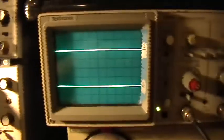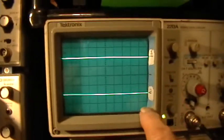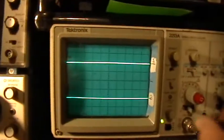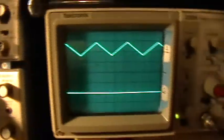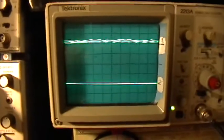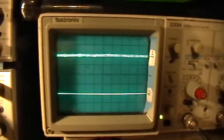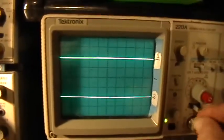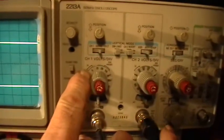So let's take a look at the oscilloscope. The top — I've got the baselines indicated right there. That graticule marker is the zero baseline for channel one and that's the zero baseline for channel two. Let me turn on channel one. Channel one is monitoring the triangle wave output — varying the output magnitude there. Channel one will be monitoring the amplitude of the triangle wave output of the function generator. That's where its baseline is right there, and we'll be looking at channel one at five volts per division because we're just directly plugged into the function generator — we don't have any attenuating probe there.